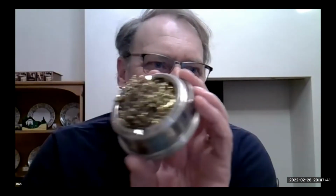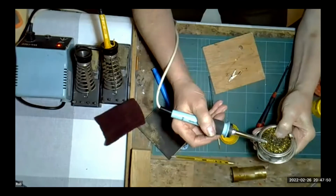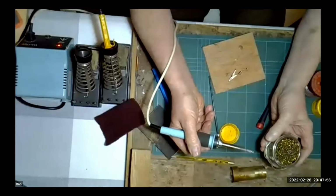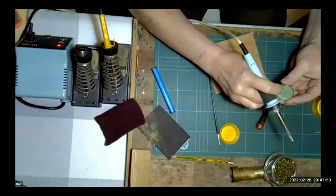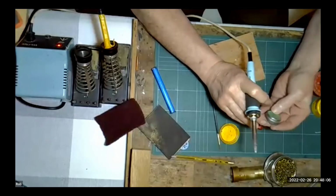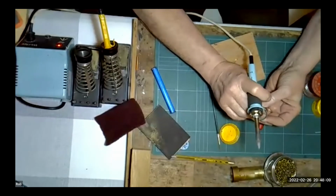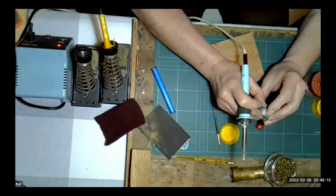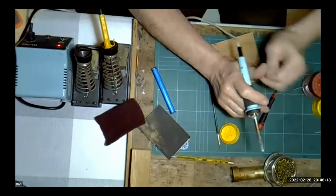These are really worthwhile getting hold of, because they're not abrasive to the extent a file would be abrasive. They're abrasive enough to remove any oxidisation. The sponge won't take that off. And then, as I say, these little tip cleaner tins. Yeah, I've got some of that. They're worth every penny. They're quite expensive. They are about £9-10 for a little tin, which always seems to me to be crazy. But I've had that one years now. Yeah, that's fine, Rob. Thank you very much. You're more than welcome.